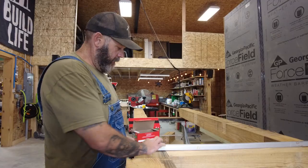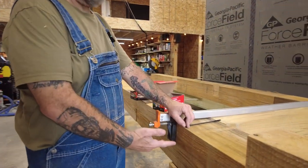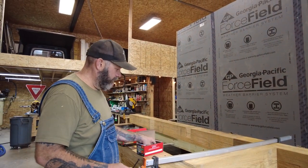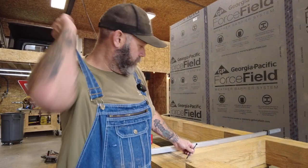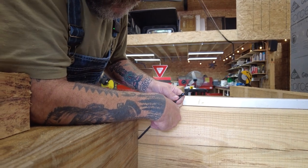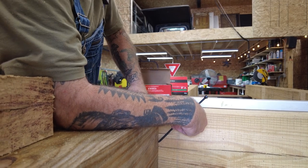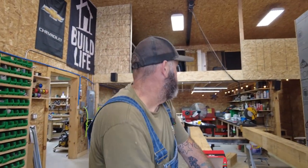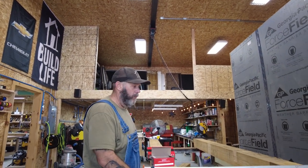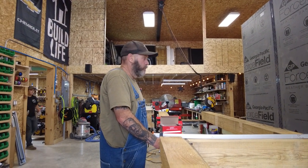We got this clamped up and I don't want to screw it like this — one because my screws aren't long enough, but two because you'll see them. These here are going to be hidden on the top, and if I use short ones and toenail them in it'll hold good, but only at the top. If I use a longer one going in from a little further away, we ought to get some meat in the middle and hold this together. Once it's up, these small ones sit in a pocket and it'll all sit on top of the wall — we're more or less trying to keep it together until we get it up there with the forklift.